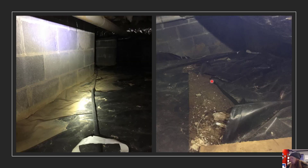Right here I want to show you a couple of things. Number one, this is the old vapor barrier — see how the plastic was not overlapped and not taped. Make sure you overlap and tape the plastic in the crawl space to keep it from coming apart. The more people crawl on the vapor barrier over the years, the more it will separate. We recommend a nine to twelve inch overlap. If you're using it as a radon barrier, you have to go a minimum of 12 inches and use a polyurethane sealant to join the pieces. If you're not doing a radon system, nine to twelve inches with basic seam tape is all you need — and that's going to be most people.